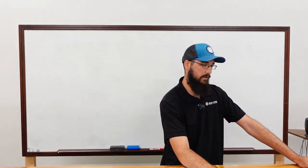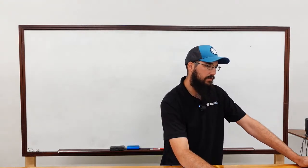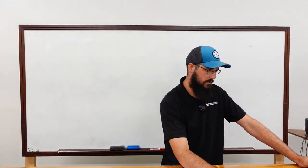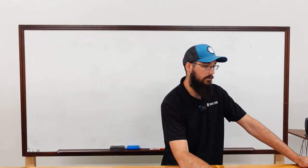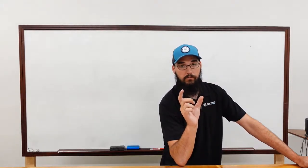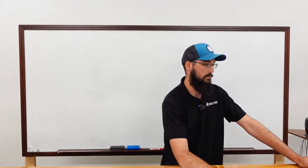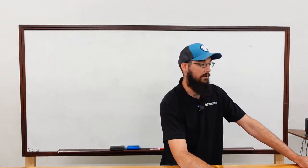Just real quick on the change tandem compressors, leave that one there. But on the solder, I recommend the 56 with flux. So we get what are their pre-coated orange flux rods, 56%, do really well with dissimilar metals in general. That's one that I can recommend.